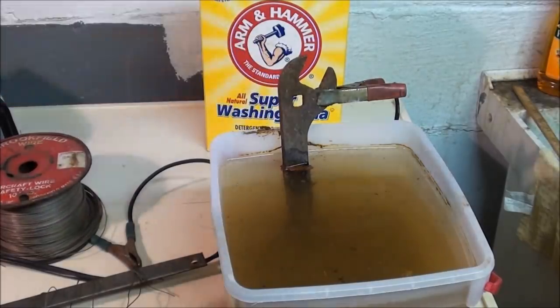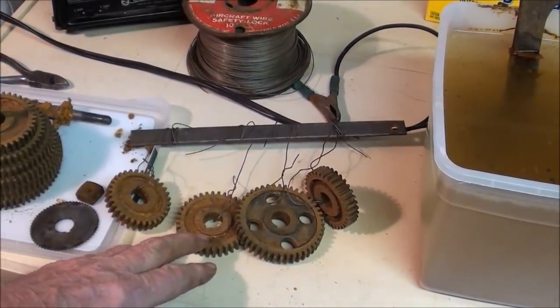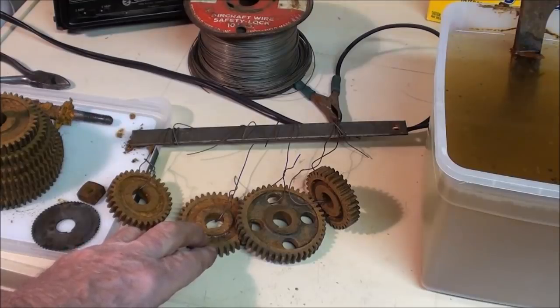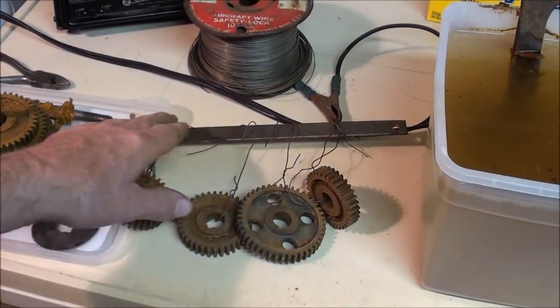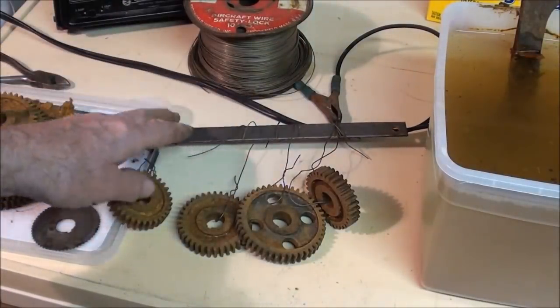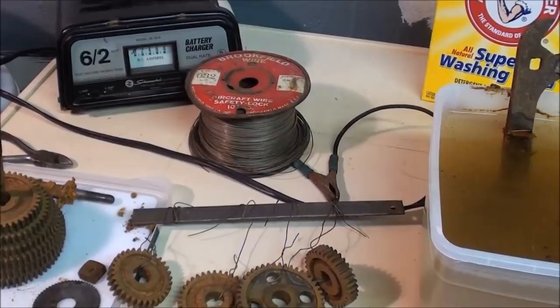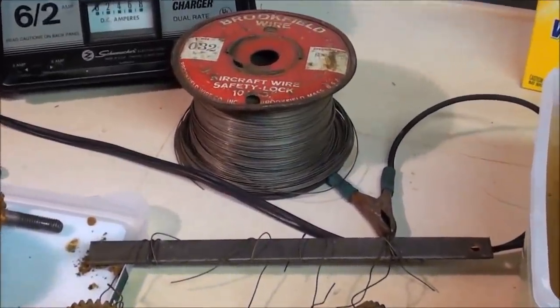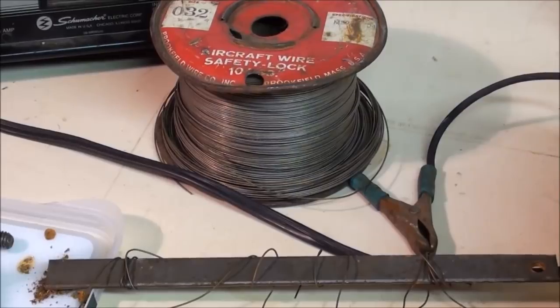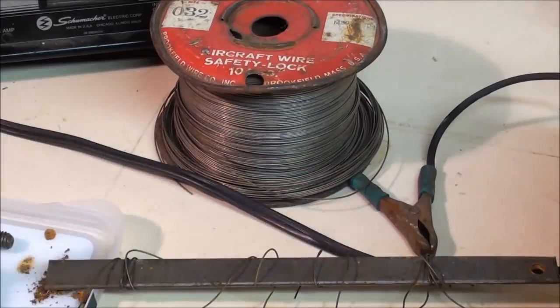I'm just using a wrench because it has a lot of surface area, and I have a lot of old worthless wrenches from farm use — the cheap stamped throwaway wrenches. You can do one part or a hundred parts depending on the size of your container, and I've put four of the gears onto a steel slab here, eighth inch thick, just something to hang it on that will conduct electricity. I like my safety wire — it's a 10-pound coil. Now, if you use too fine of a wire, sometimes it will quickly disappear and the parts will drop into the tank.